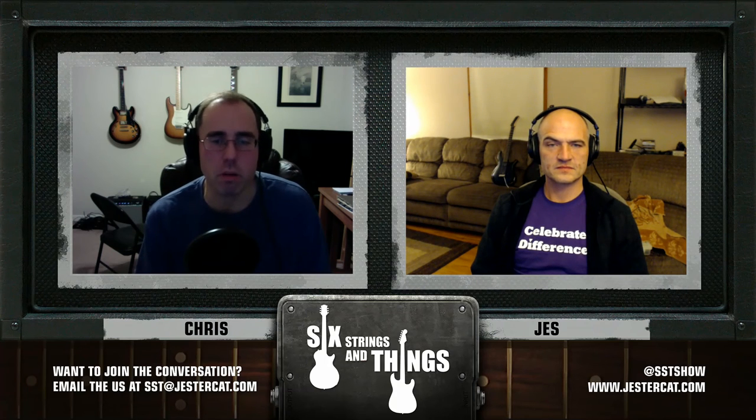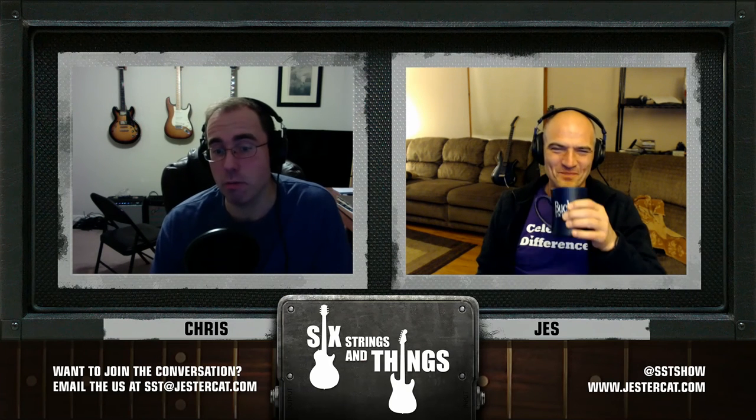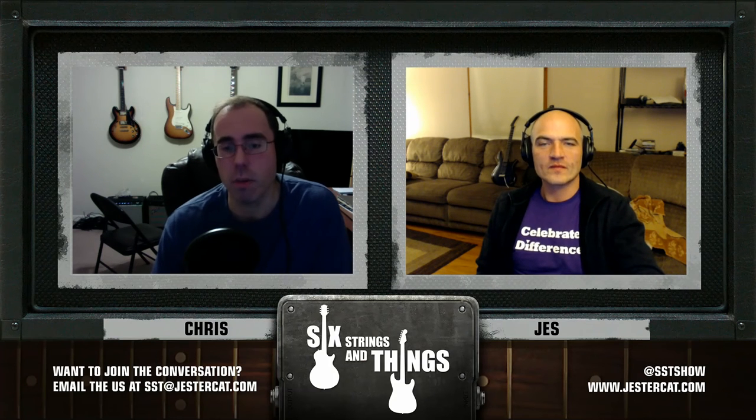There's apparently a fat switch on the Blues Junior that I did not see while we were messing around, but I've been reading about online. It might be worth watching some videos and listening to fat switch on versus off to see what kind of difference it makes. I've also heard that on that amp the spring reverb is prone to breaking — if you put the amp on its side to move it, you can kiss that spring reverb goodbye. Though it's supposed to be a simple fix, like a $5 repair you can do yourself.